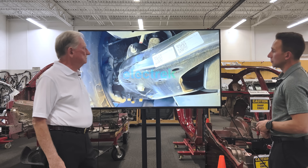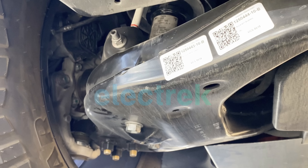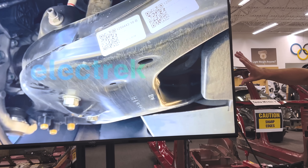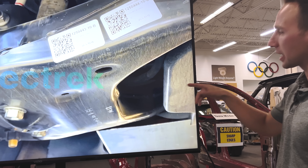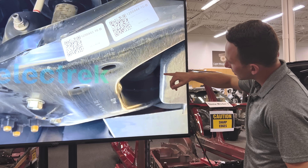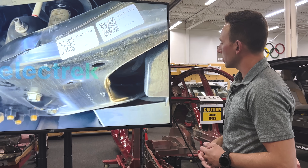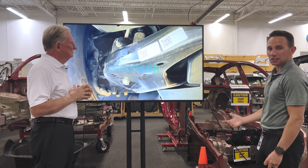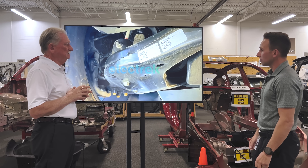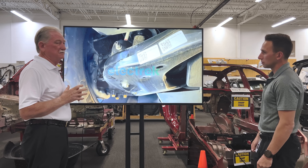The debate over whether that other shield is carbon fiber or not — it's a grainy picture. It could be a textile PET, which is great for NVH, but at the rear of the vehicle that wouldn't make much sense. Similar to the front, it does look like there's an ever so slight witness of a cross hatch, which would suggest SMC carbon perhaps. Overall, carbon is good for puncture resistance, lightweighting, and stiffness — and any off-roading experience is going to give you a whole lot more protection if that is carbon fiber.